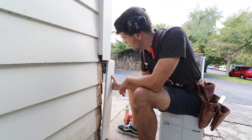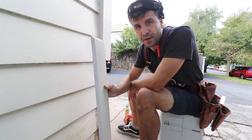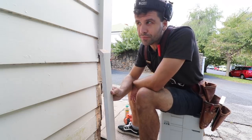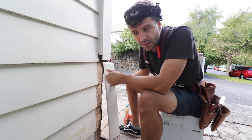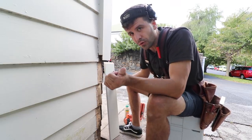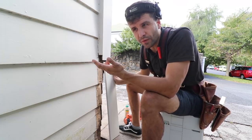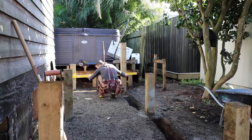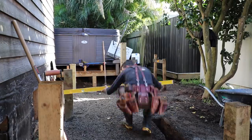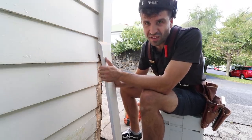I'm putting in H3.1 but the only difference I'm making is that I'm keeping it up off the ground, whereas they poured the concrete slab around the timber and that's what rotted it. Now if you want timber to go into the ground — you try and avoid that if you can — but if you have to put timber in the ground in New Zealand, you have to use either H4, H5, or H6. H6 is what they build wharves out of, H5 is what house piles are, and H4 is like fence posts and landscaping timber.